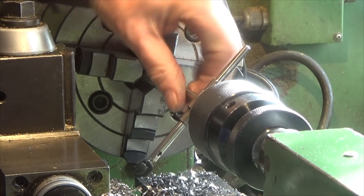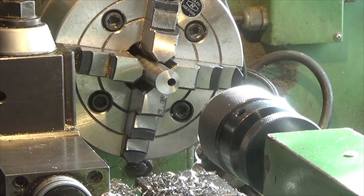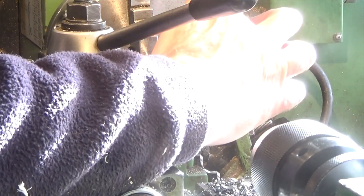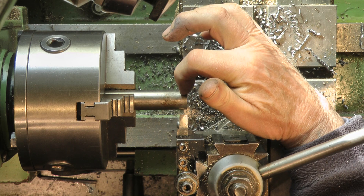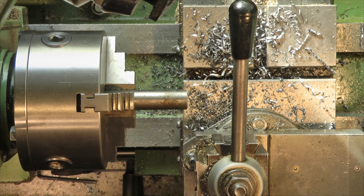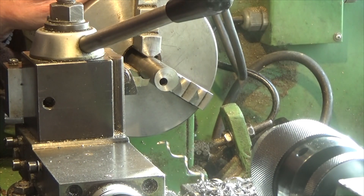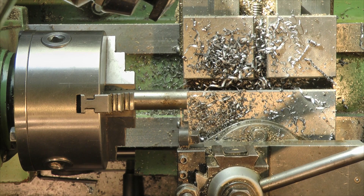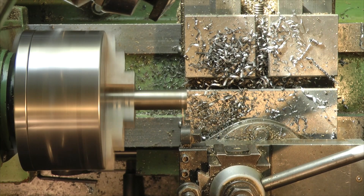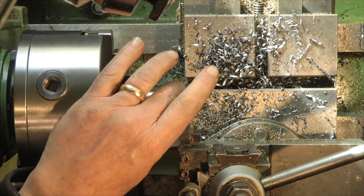There we are at the bottom, and we can transfer that now to our three-jaw chuck. In the three-jaw now, what I have to do is cut a little recess in here — three-sixteenths of an inch wide in this quarter-inch area. I'll put my little parting-off tool in — that will do very nicely for this. Let's check that's on height — yeah, it's okay. So I'll gently cut this recess in here, just opening this out.